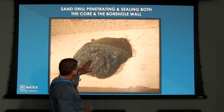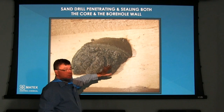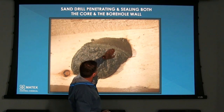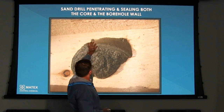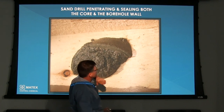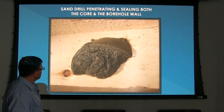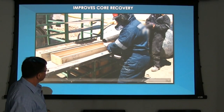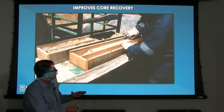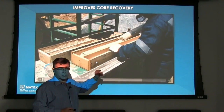This picture demonstrates the porosity of some of the boreholes and core itself — you can see how the product and moisture have penetrated into the core, only so far, wrapping everything up. With the Torqueless on the outside it allows it to slide in and out of the barrel quite nicely and take up any formation. Here is a small piece of core from wet sands — the sand was very wet before we entered the hole. The Sand Drill got in there and basically looks like the inside of a rubber tire it's so well wrapped. In this video here it's pure sand — watch the pliability — you can see how it's got the sand wrapped and even allows it to bend a little bit as it's coming out of the tube. We're achieving 100 percent core recovery in pure sands on this job.